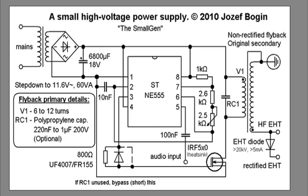The first thing to notice is the flyback transformer depicted in the schematic has an EHT diode — a high voltage diode — that he says you need to add. He's assuming the flyback outputs AC and wants you to rectify it to DC. However, about 95% of the flybacks you'll get from modern televisions are DC package varieties with an internal high voltage diode already, so you likely do not need to add this external diode.